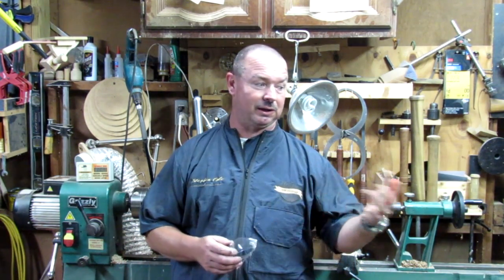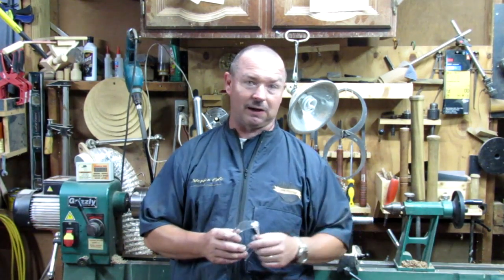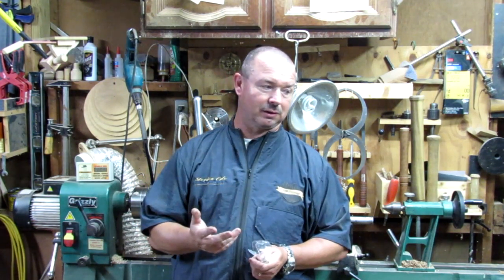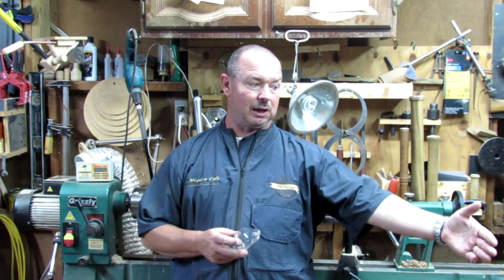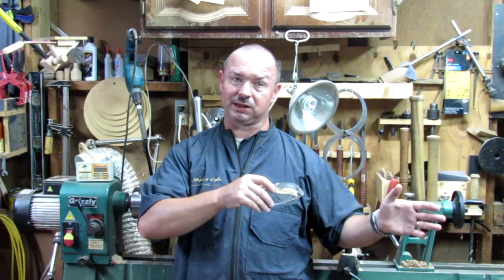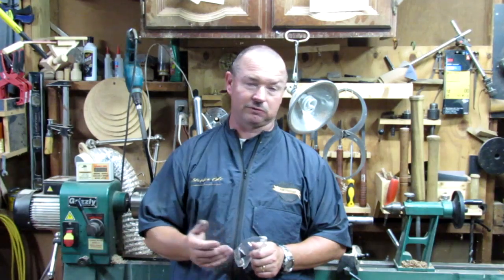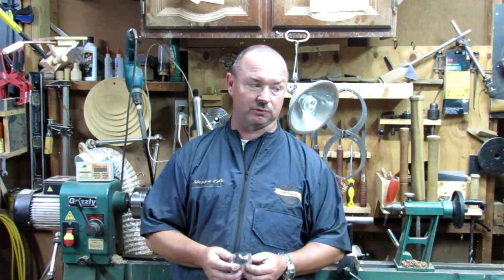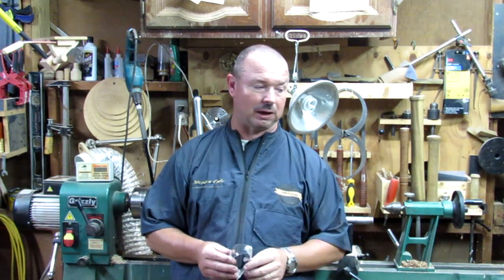And the good thing is I can get it in different grits. I can get it, I believe, from 60 to 2000 grit. This is a 500 grit, so it gives me a nice sharp edge. I don't really need a grit any finer than that, but I could take it on up to a 2000. All I have to do is swap the wheel out, and the whole system is still set up for the new wheel. So I can swap the wheel out, and I can still get my same bevels and everything from the lines I already have drawn on my little pivot right there.